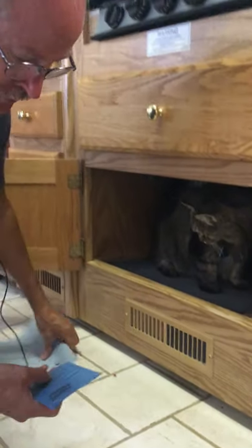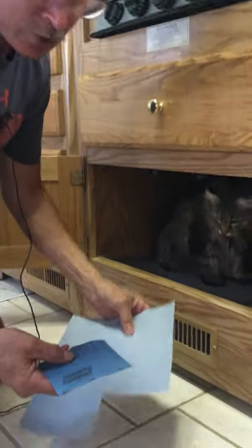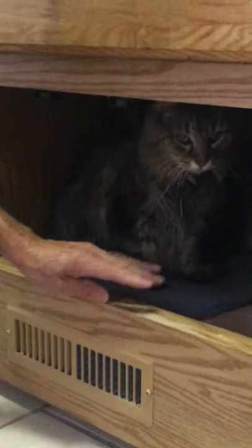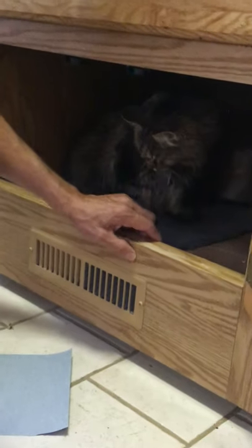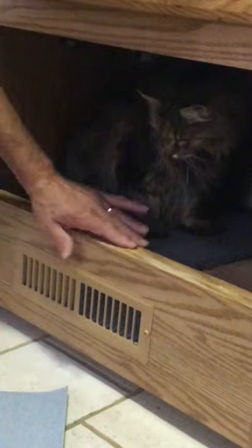The first thing we're going to do is take some 100 grit sandpaper — I cut a section off — and we're going to sand gently where the plastic was. That should remove the plastic. Then I'll get a finer grade sandpaper to make it smoother, then mask off the front and the back so when I stain it and put a top coat on to match the gloss, it'll be protected and it'll keep Julia from getting stained.